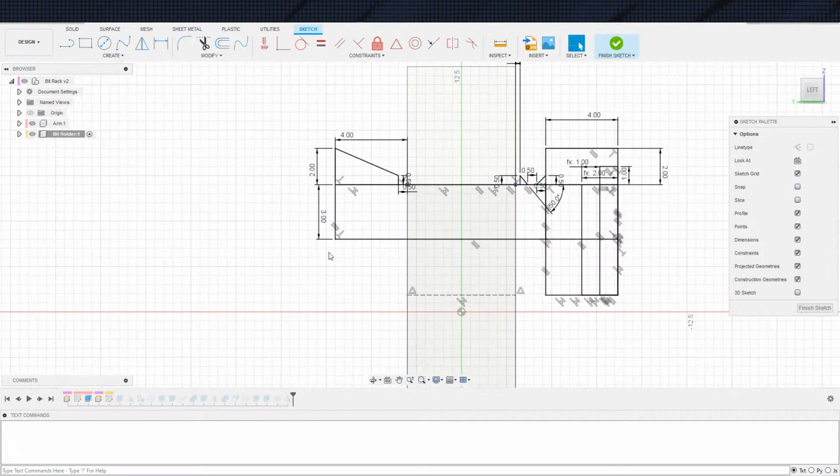Oh, actually, this is 3mm. Is that really 3mm? It feels awfully thick. Where's my calipers at? There they are. So this, I'm going to take down to 2mm in that case. I mean, my calipers are saying that they're a little thicker than 3mm, but not by much. And it's one of those things, it could just be a little bit of elephant foot that I'm picking up here, since they're printed on the edge that I'm measuring right now. So yeah, these will be going down to 2mm then, in that case.